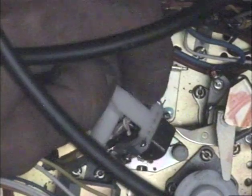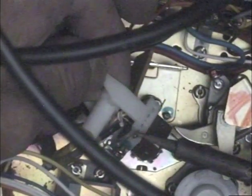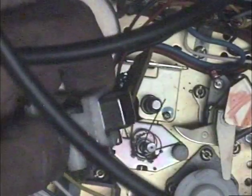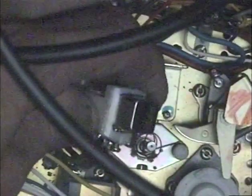And I just wrap this 20 gauge steel wire around the bracket, and then where the two ends meet, of course, I solder it together so that bracket will never crack again. And then at this point, we can now put our head back in there, get that grounding piece back in there, and screw the screw down nice and tight. And as you can see, this head is very firmly held in place now, and there's no further cracking of the bracket.